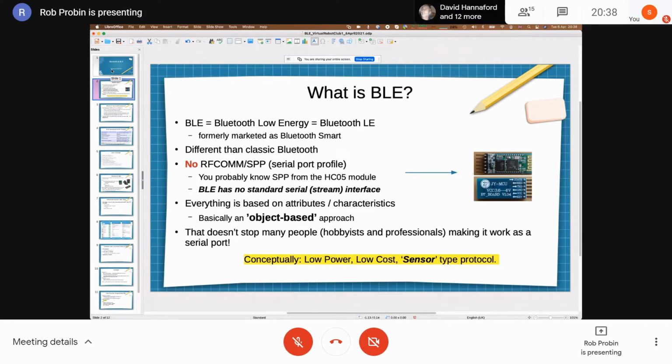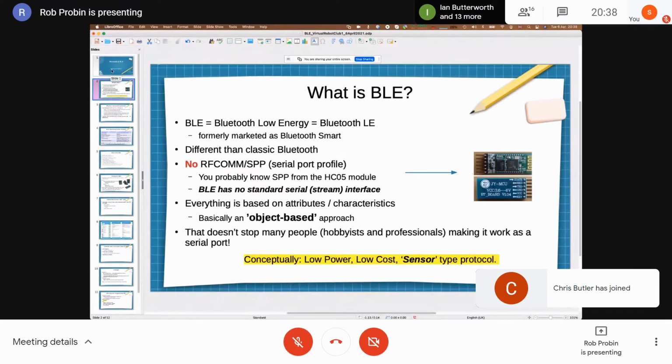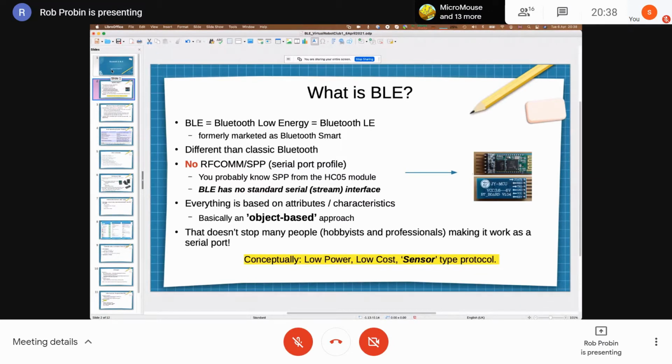It's originally a very different use case, although, as I mentioned, plenty of people are extending it to do other things. In terms of commercial products, you obviously might want to do a firmware update over this interface, but that's really not what it was aimed at. To give you an idea, before Bluetooth 4.2 was introduced, the maximum data payload you could transmit was 20 bytes. It's wrapped up in what's called a GATT attribute, which is wrapped into an L2CAP, which you can theoretically do fragmentation with, and that's wrapped in another payload, as per all of these protocols. But generally, before 4.2, which brought the DLE extensions, it was 20 bytes maximum you could send on a particular characteristic.